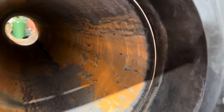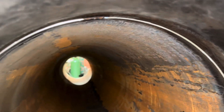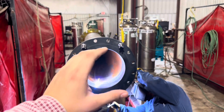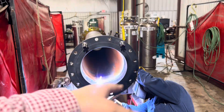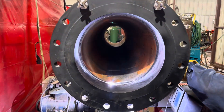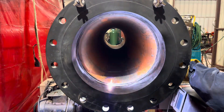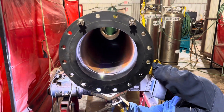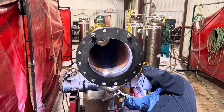He had to transition the inside a little bit so the pipe is flushed — no high-low. Sometimes the pipe doesn't fit correctly and it'll come out like an oval shape, but you just have to trust in the fitter's experience to give you a good fit even though the pipe is kind of warped. It'll make the welder's job a whole lot easier.